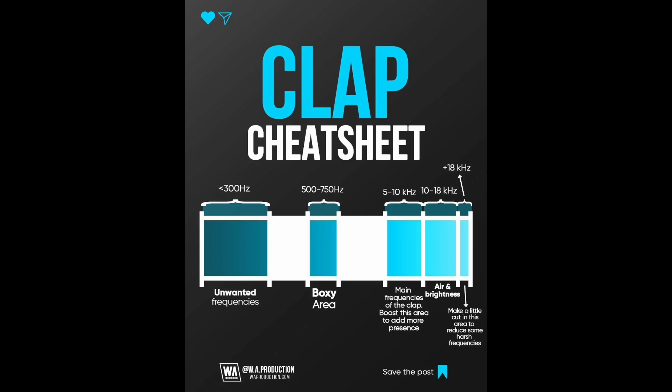I thought, man, that's weird. So I actually went and Googled the frequencies for hand claps and looked at the data. Around two and a half to five kilohertz is where there's the slap of the hand clap. When you turn the speakers off-axis away from you and point them more out into the room, there's a strong peak around five kilohertz that drops, and in doing so it alleviated that sharp sound.